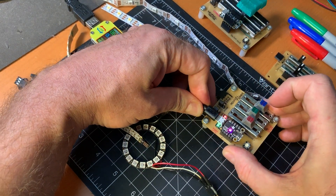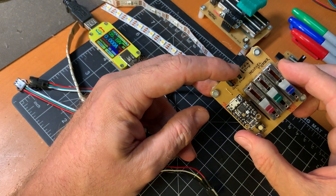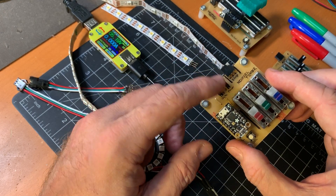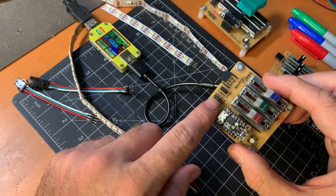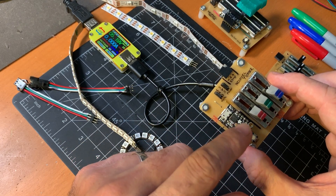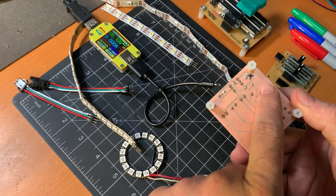The way it works for all strips is it's got these two jumpers. The power jumper lets you supply 3.3V or 5V to the strip. The 3.3V is coming directly off the Trinket so you can't power very many LEDs that way. The 5V is coming directly off USB. The data jumper is a little more interesting — in 3V mode it's just the data line from the Trinket, but in 5V mode it's going through a small level shifter that's soldered on the back.